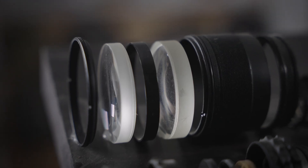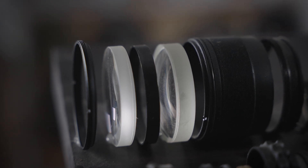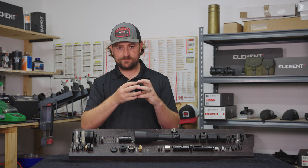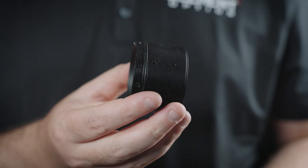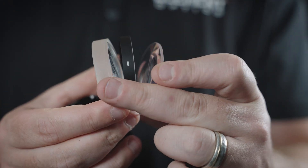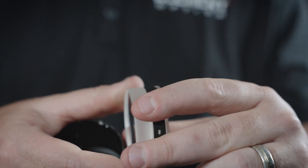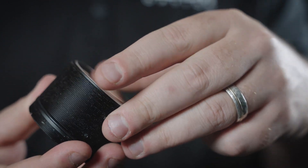That focal plane lies right here, basically where the turrets are. To explain this a bit better, we've got our expanded view of the Titan objective assembly, and I've also got a Nexus objective assembly separately so you can see how everything fits together. The body tube of the rifle scope is threaded on the inside, and the whole objective assembly threads in and is held in place with a lock ring. Inside the assembly you have all your lenses, plus a series of spacers and lock rings that position and hold the lenses correctly.